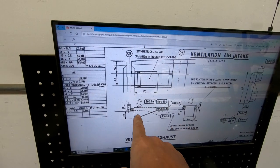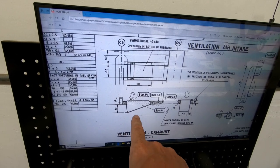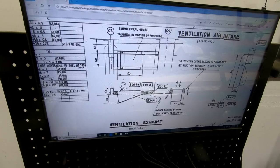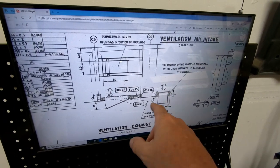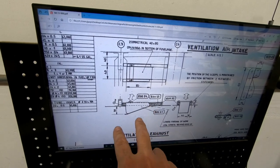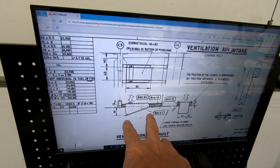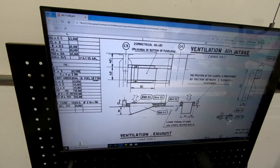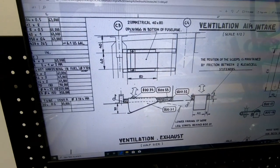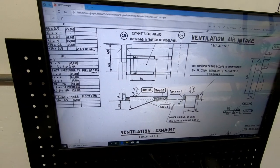There's no flat plate drawing in the plans for the intake vent, so the design has to be interpreted from a 3D drawing to figure out how to bend something the right length that fits in the 80-millimeter opening, locks into place, and opens and closes properly. CAD software was used to create a flat plate drawing.